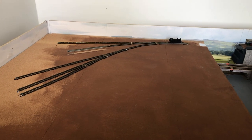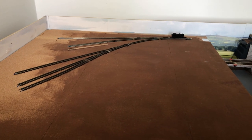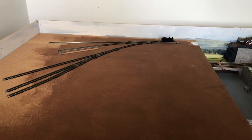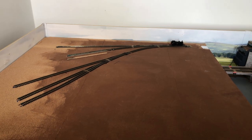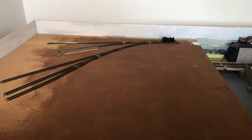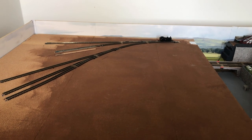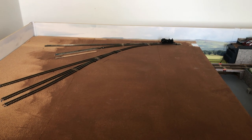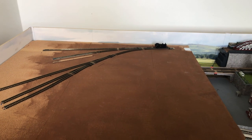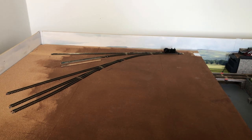And that's a different approach to what I was going to do, which was essentially copper strips underneath to which all the lights would go, and then power coming into the copper strips. The other advantage of the distribution board is that I can set it to bring the voltage down from 12 volts to 3 volts, which is what I need the voltage to be for the lights that I'm using. And I don't then need to put in individual resistors or a resistor in the system, because it's being done by the distribution board.